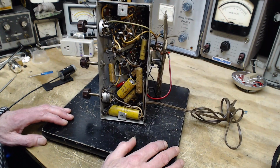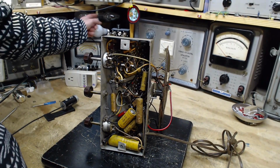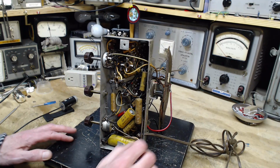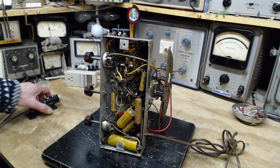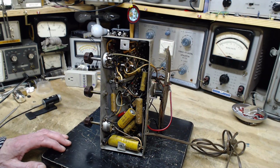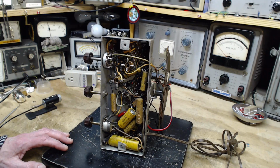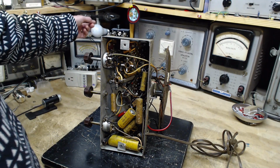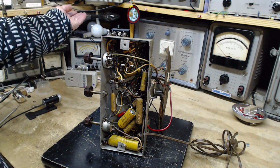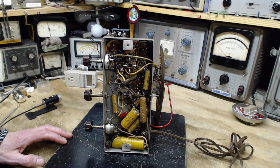When I start these guys up first time, I run the power through a light bulb, through an incandescent light bulb. These light bulbs here. So if there was a problem like this hidden away in there, and there was a short circuit, rather than rely on the breakers at Sir Adam Beck number 1 in Niagara Falls to open, or my house fuse, my house circuit breaker, I have circuit breakers here, my circuit breaker to open. Instead, all that would happen is these lights would get really bright, and they would restrict the amount of current flowing in this problem. And I would become aware that something's going on right away, because the lights would be bright, and they shouldn't be. They should be dull or dim. This is called a dim bulb system, if you like, or a dim bulb technique or method.